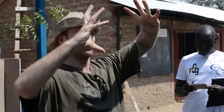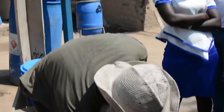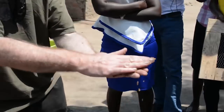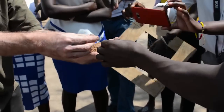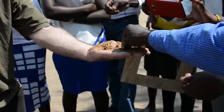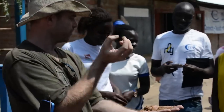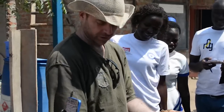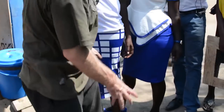If you've got big chunks — almost like small rock — then the spaces are too big and too much water gets through and it doesn't get filtered properly. So this is about the size of sand that you want: basically quite coarse sand. The fine stuff is like dust, and with that in it the water just sort of didn't go through at all.